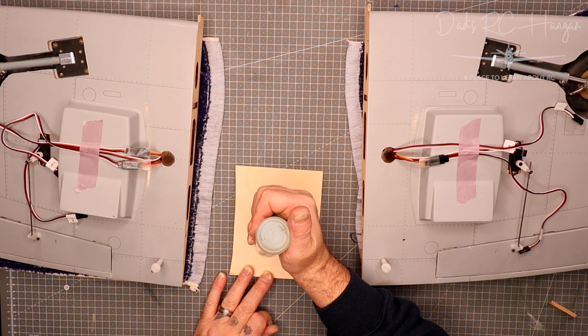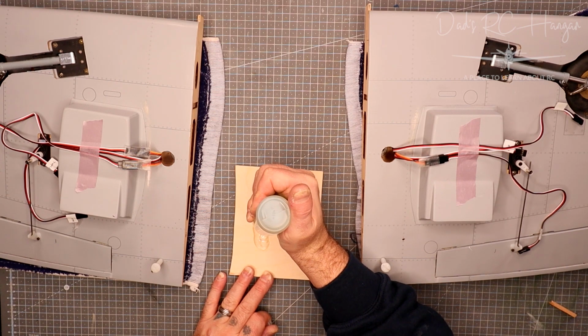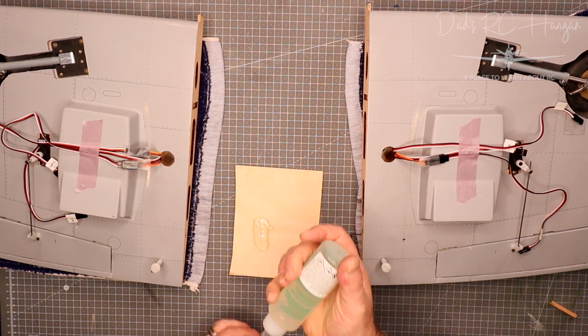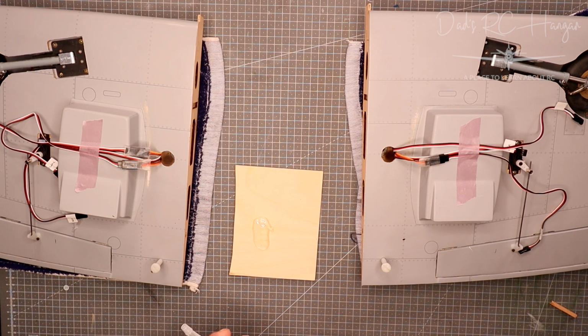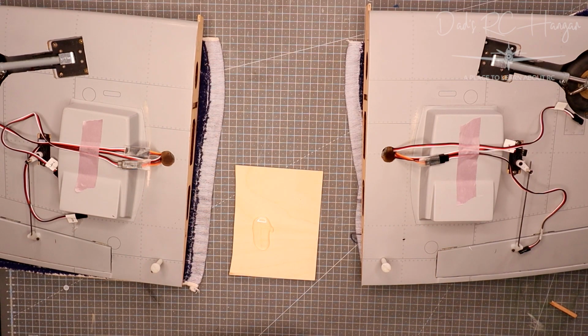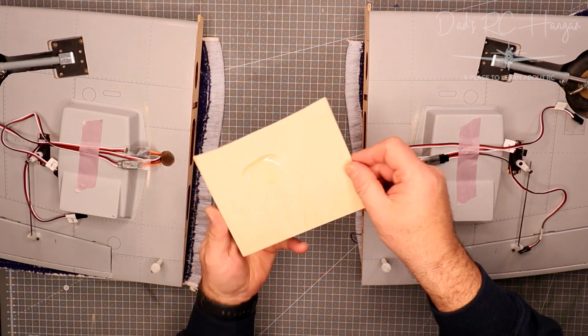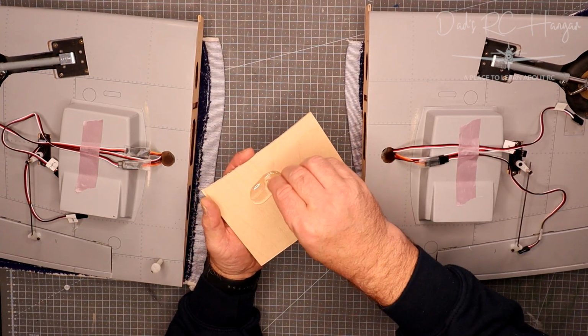But then again, it's 30-minute, so just remember equal parts of each one. The stinky one, as I call the hardener. The stinky one's always the hardener, and the same amount of hardener as resin. And then I just normally use a stick to work it together.